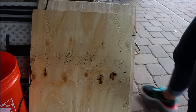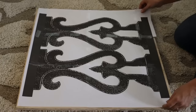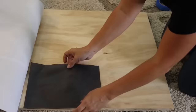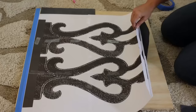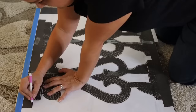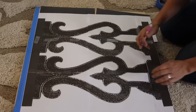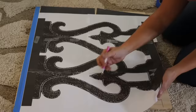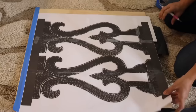I start by taking this 3/4 inch piece of plywood from my scrap pile. I designed a free printable, which I will link in the description box below for your personal use, but it's designed using an old antique railing pattern, and you can print it out on your home printer and then just tape them together. Then we just take some blue painter's tape and tape it to our plywood. Using graphite paper, we transfer the image onto the wood. Now it's time to take this piece outside.